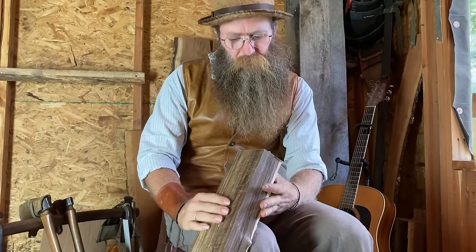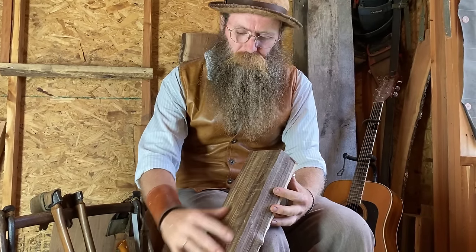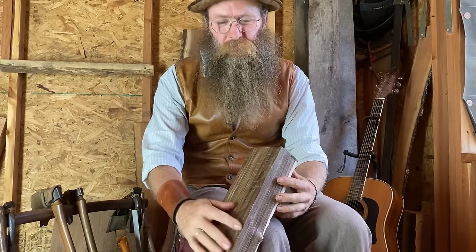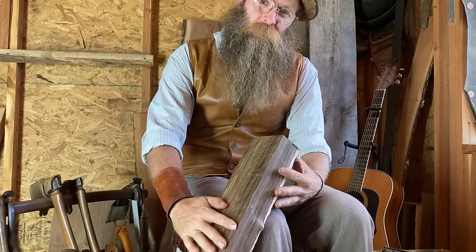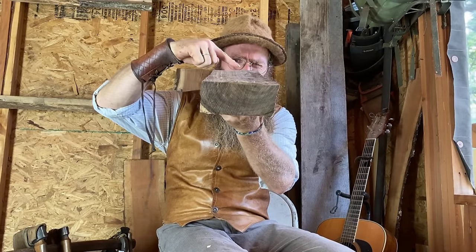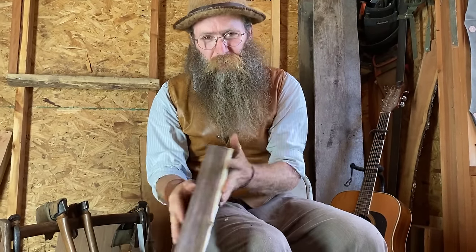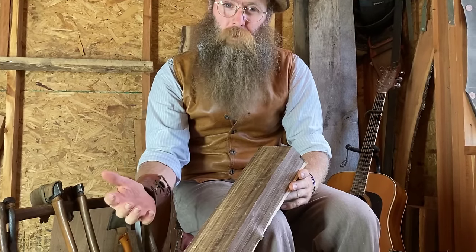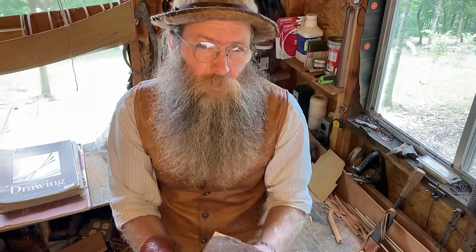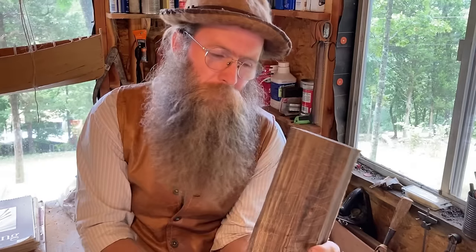When truing up your piece of wood, you don't have to spend all day making it exactly perfect — that would be a waste of time. But you do need to do a good enough job so you can draw on it reasonably effectively, getting back down to clear solid wood. You'll also notice there's no propeller twist — one end of the board is not canted relative to the other. Before drawing anything on your blank, look it over thoroughly and assess both ends — that will help you decide which way to orient the spoon, bowl down here versus bowl up here.